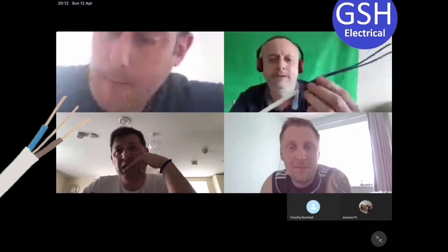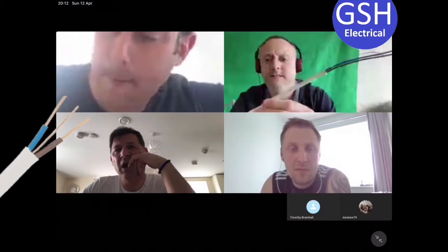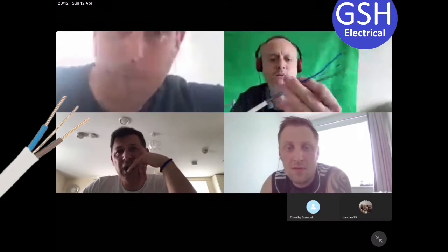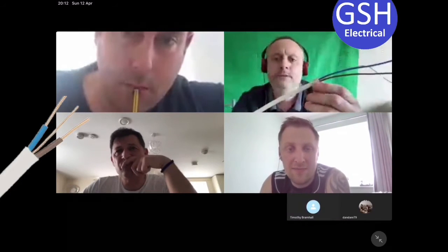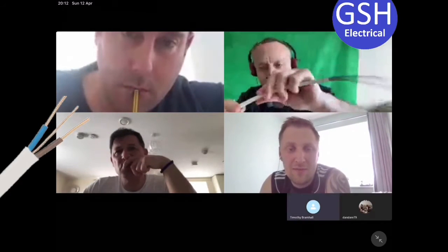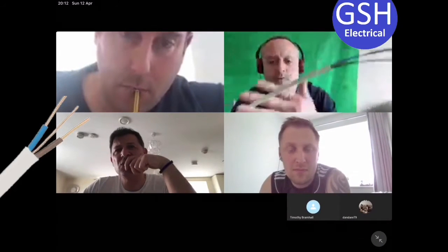Yeah, and we've got a video on the channel talking about that. Can anyone remember, and this is open to everyone, what's quite difficult about using this as a wiring system? Exactly the same colour conductors, etc. It's very hard to manipulate, isn't it? It's really difficult to get nice bends on it because of the properties of the PVC. This low smoke zero or no halogen outer sheath cable is really difficult to work with.